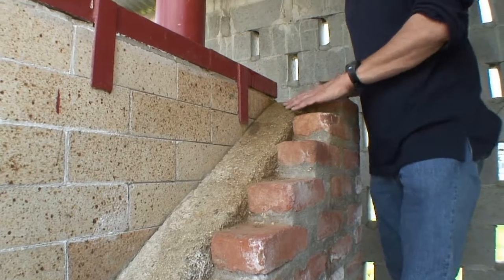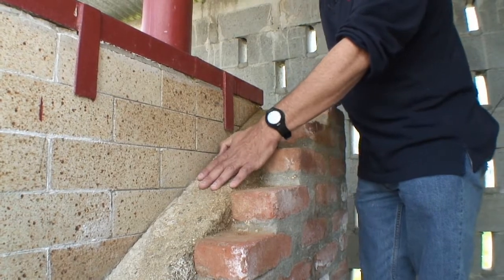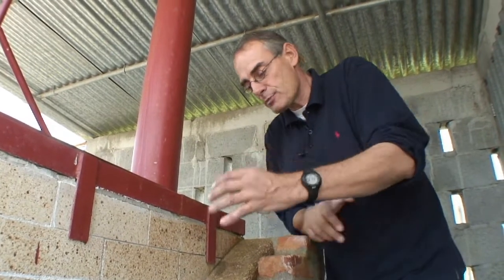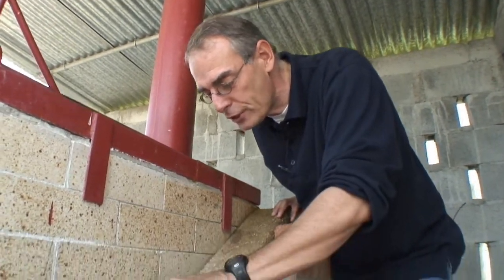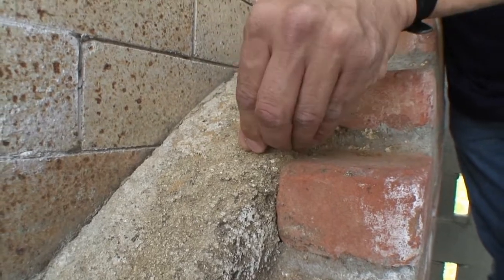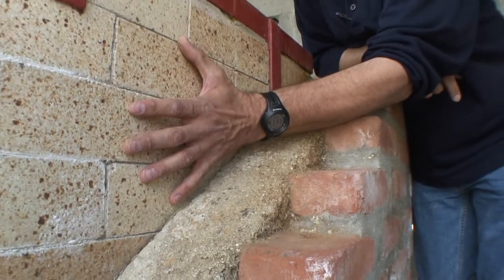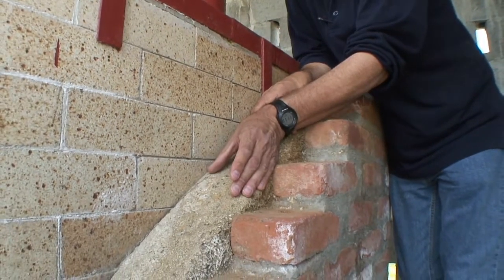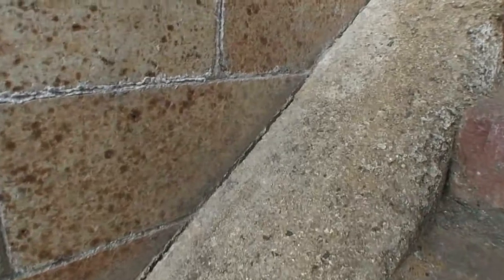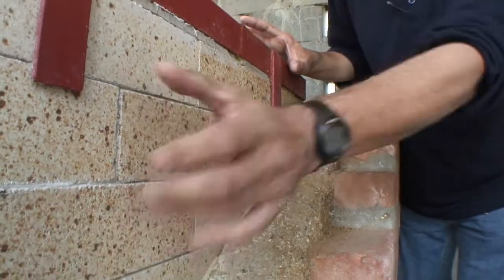This gap could stay completely open since air is a good insulator, but if humidity enters it could damage the refractory part. So what we propose is to put in a layer of what we call vermiculite concrete. Vermiculite is a very soft insulator mixed with some cement — if you push your nail into it, it gives just a little bit, meaning it is hard but compressible. So if the refractory bricks expand due to heat, they will compact the vermiculite concrete. The space you see here is what was taken up by the dilatation of the refractory bricks.